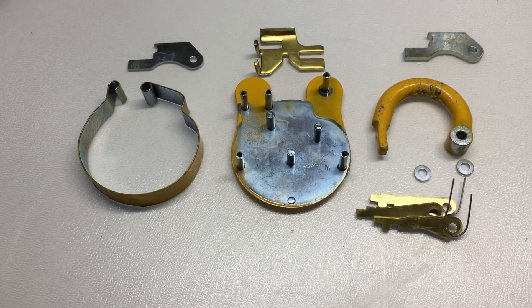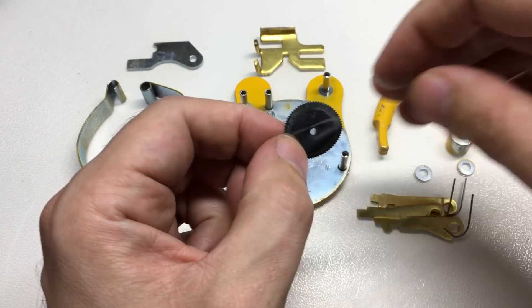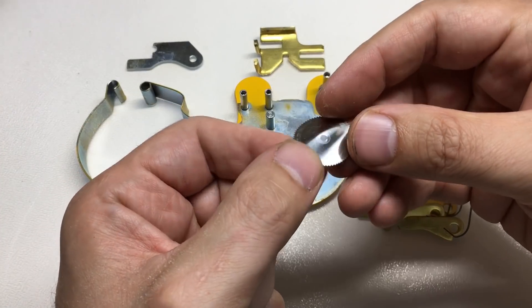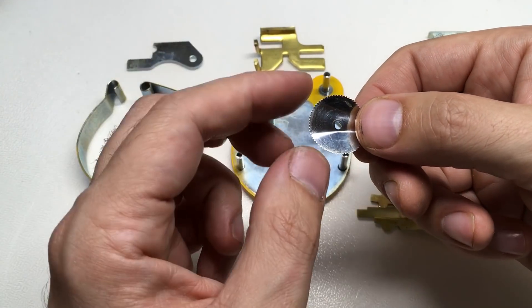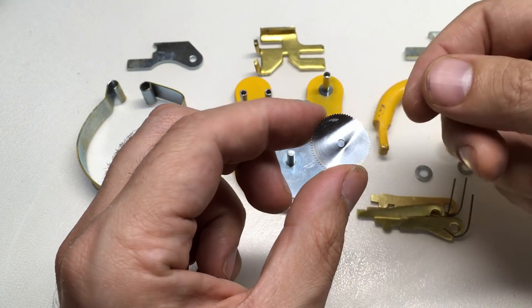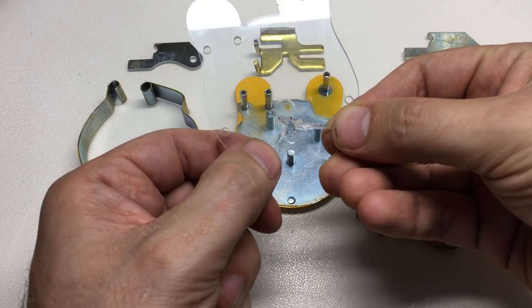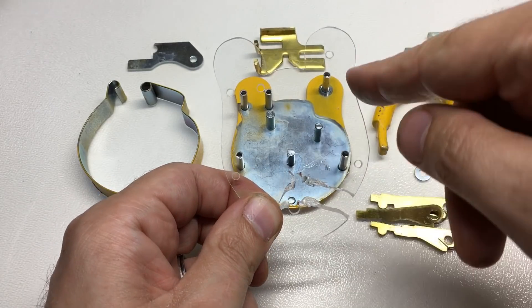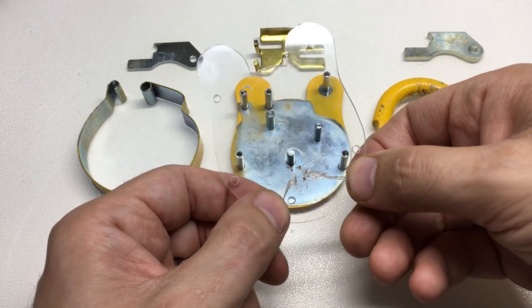The other thing is this — and this is what I accidentally stood on — but this multi-tool is absolutely brilliant for cutting acrylic or perspex. Use the lowest speed you can. You can use a fret saw and things like that, but this just made light work of shaping those curves, which is quite hard in acrylic. I was doing so well doing an acrylic front, and then I just drilled out the keyhole and look what happened — it cracked. All of that shaping. If you've ever worked with acrylic, getting those curves smooth is a nightmare.